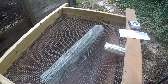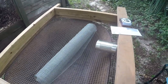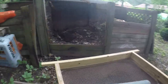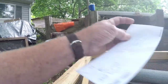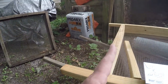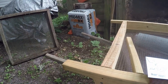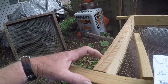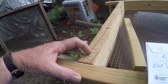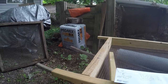On this particular wheelbarrow, since it's 27 and a half, less the width of one of these, that means it's 26 inches. You would cut both pieces 26 inches long. The handle is five inches — put a mark, square it up. You want to make it square and not catty-corner. Put three deck screws in here. Since this is an inch and a half, you'd need at least a two-and-a-half-inch screw; a three-inch screw would be even better. It would take 12 screws to put this on.